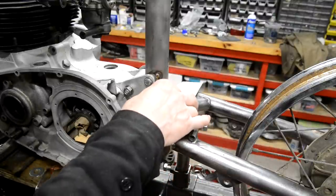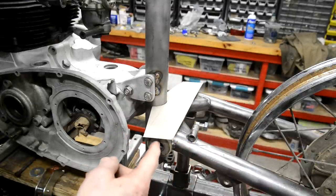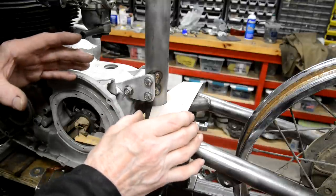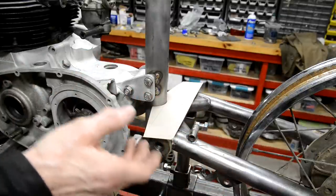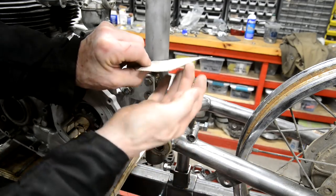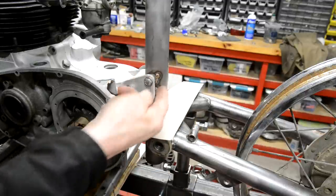What I'm going to do is, we'll make the box on the swinging arm. So I'll make the ends, I'll put the bolt through, the spindle through, fasten them up tight, cut the top and bottom, and then set them on, and I can make sure everything's square. We'll have this actually on the welding table, and I'll make the box. Then we'll bring it over here, we'll set it where we want it. I can do some tacks up here, and I can do some tacks, if you imagine this is the bottom, on the bottom of it. Then we'll take the swinging arm out. Then we will bronze it in all the way around, above and below.